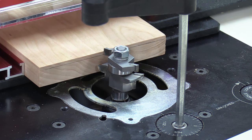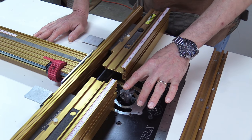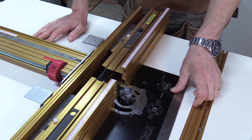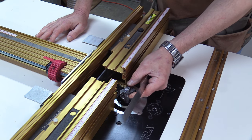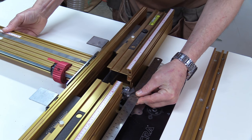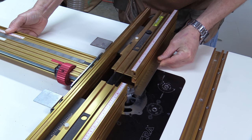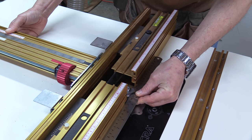That's where I need it to be, so I'm going to lock that in position. With the bit height set, now I can set up my router fence. I've got a steel ruler here — there is a ball bearing right here — and I'm going to rest that steel ruler against the bearing and adjust the router fence so I'm kissing that ball bearing and hitting the fence.